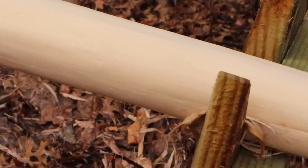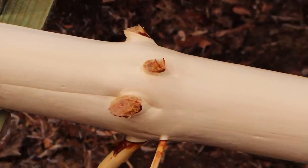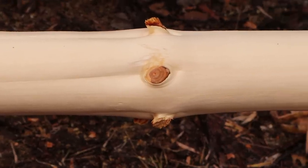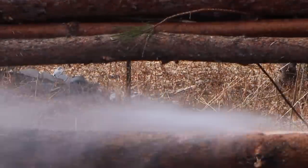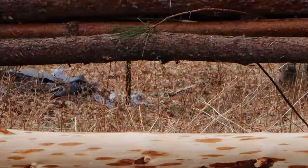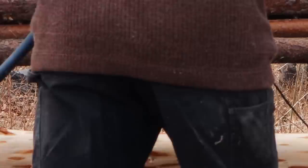See how silky smooth that is, cleaned up like it is? Just shiny and smooth. But if you approach it at more of a straight-on angle, like 90 degrees, it would tear that wood apart. Take note — look at how steep the angle of approach is. I'm running like 15 to 20 degrees to the wood instead of 90. Very steep. Otherwise it'll just shred it.